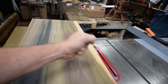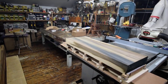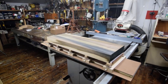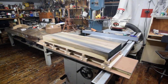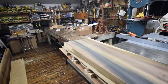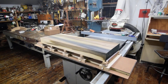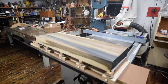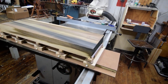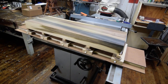Now there's no rock in this. When this gets passed through the planer, you'll end up with a flat jointed surface. Once you have one surface like this board has, you can flip it over and pass it through the planer as normal, and you'll end up with flat boards. The plans for this are in Volume 23, Issue 137 of Shop Notes Magazine.